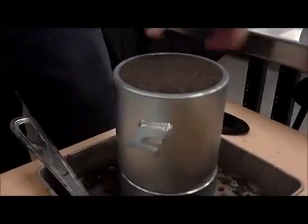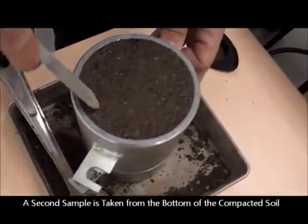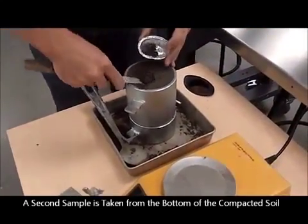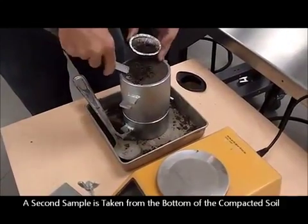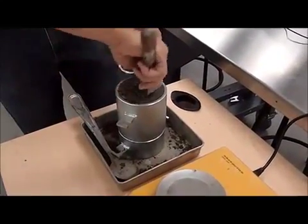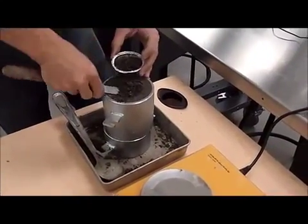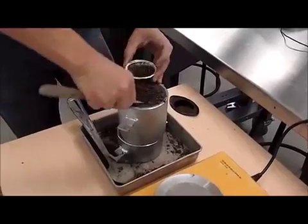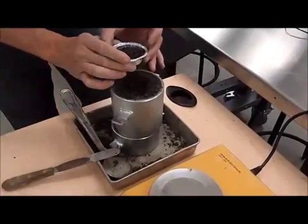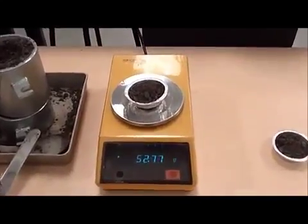If you notice with some materials you may have some air voids due to lack of proper compaction. This gives you some certainty that the compaction process worked out representatively. Also, if the material was not thoroughly mixed, you start seeing some dry pockets compared to some wetter pockets of material. This granular material is fairly workable and clean. If you do the Proctor test on a clay material, it will be a lot more challenging.